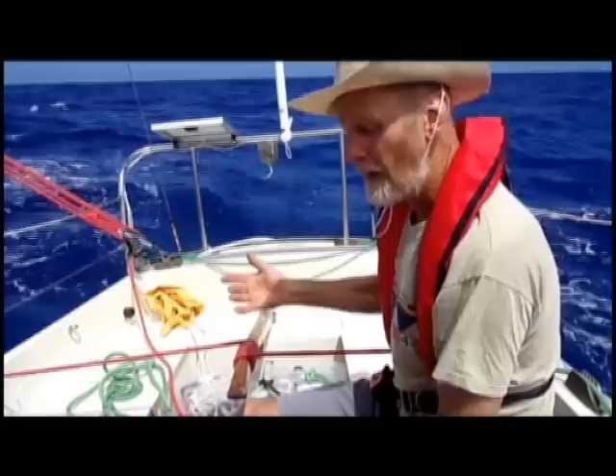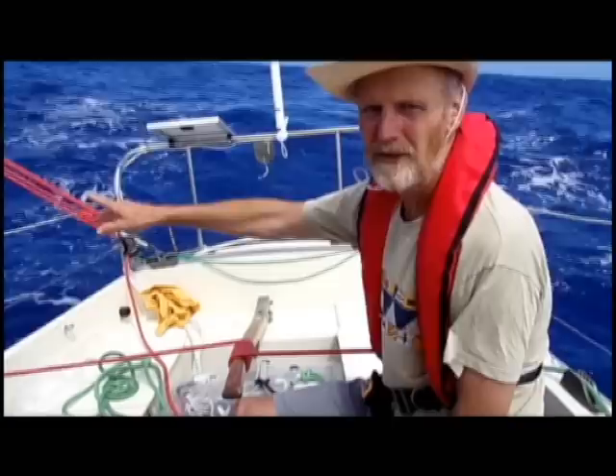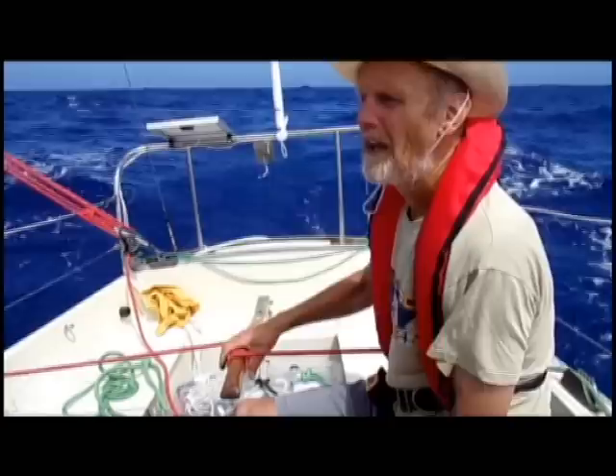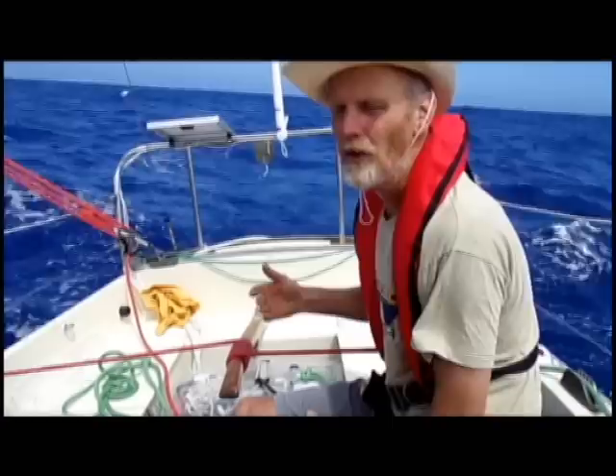If it's not right, just make a small adjustment and then give it time to see if that's all you need. So if we're rounding up into the wind, we would add a bit more tension on this side to bring the tiller over to windward. Vice versa, if we keep running off downwind, we would adjust it the other way. Each time you adjust, if you don't get it right first time, the adjustment should be smaller and smaller, and you will home in on the ideal position. The time interval between adjustments needs to be longer, because there will always be a certain amount of yawing.